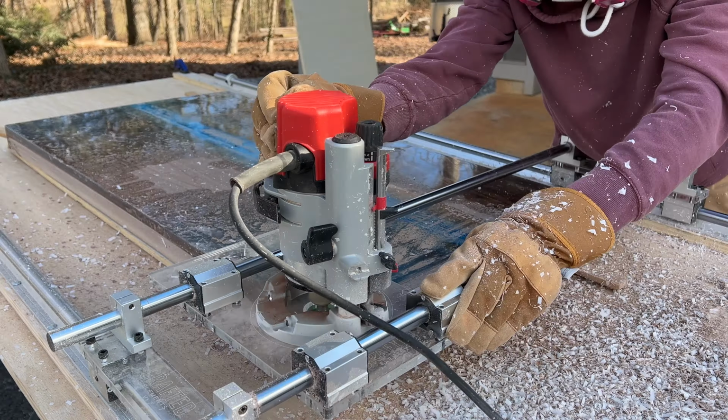We have some imperfections in our epoxy. This is maybe where the router bit that we were using to surface this coffee table was getting dull, and maybe it chipped out some epoxy. But we want to correct that now. What I'm going to be using is a little CA glue. It's got kind of a two-part glue, so you just fill in the hole, spray it with the activator, and in about 30 seconds, it's ready to sand. So it's a lot quicker than trying to backfill this with epoxy and then doing a lot more sanding. This is just fill it, spray, should go pretty quickly.